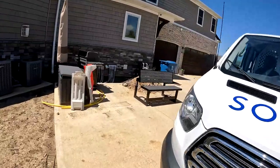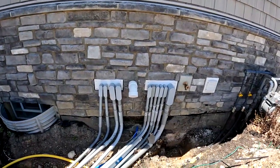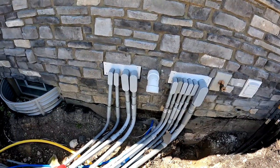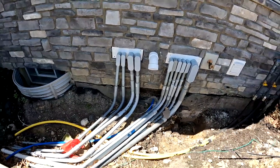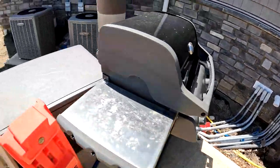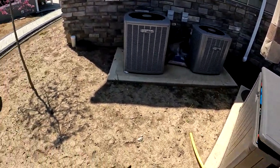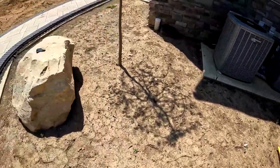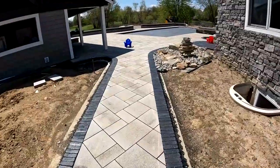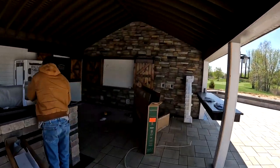These are the conduits — not all of them are ours, but some are. This is how we're getting wiring into the house basement storage area: electricity, audio, low voltage, lighting — all of it. The conduits are all glued because we're using a vacuum to suck the lines through. Before you suck the lines, you put a little plastic bag there — there are plenty of YouTube videos showing how to do that. It comes along here and goes to different areas as you saw in the other videos. By the end of this video, we should see the 65-inch in that space.